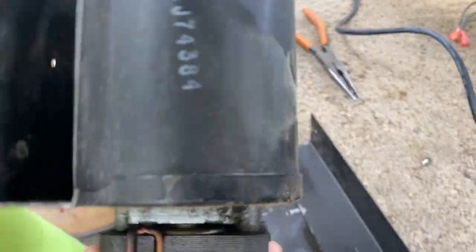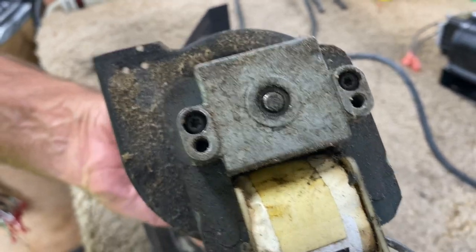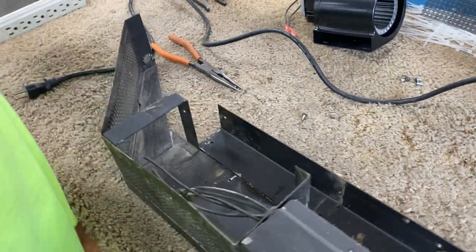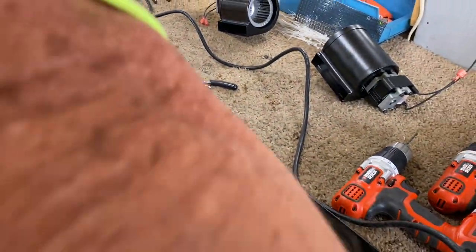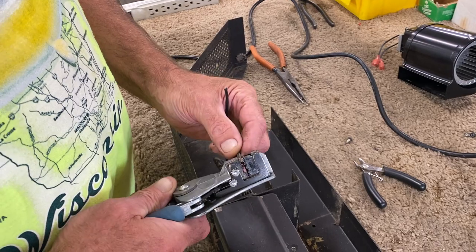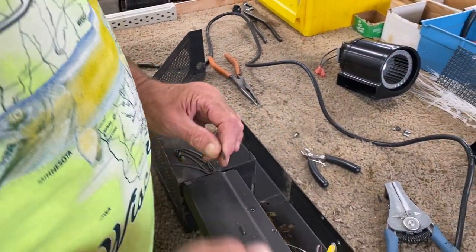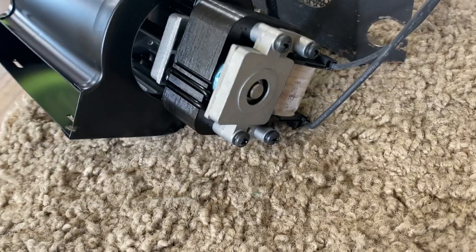The wheels get dilapidated, so we'll discard that. All Jim is doing in this case is cutting the motor leads as close to the motor as possible, leaving as much available wire as possible. Flip that over, Jim. If you look at the motor on the outside, that looks like a sleeve bearing. What happens is we get a lot of dust and debris caked into those bearings, so over time the bearings get fatigued — very difficult to service. That's another reason why occasionally cleaning the blowers is definitely recommended. Jim is stripping a couple of the wires. These wires can be reconnected in any order — the motors are non-polar, so there's no positive or negative.